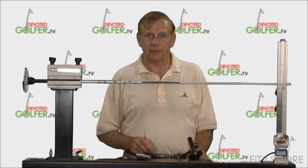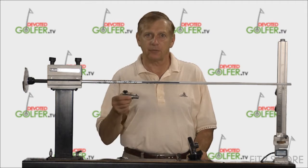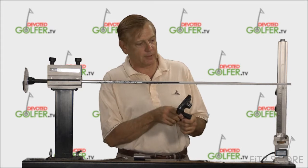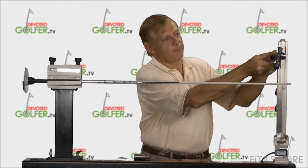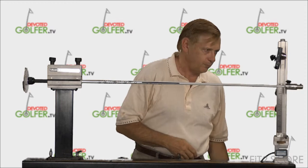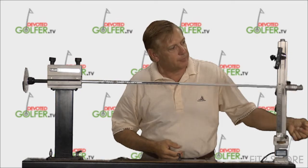By now you're probably wondering where this discussion is going. It turns out there is an easy way to find the stable side of a shaft. It's done with this little tool — a weighted laser pointer and a digital camera. I'm going to set my camera to a two-second shutter delay, a five-second exposure, and clamp it to the arm of my deflection device. The laser tip pointer goes on the tip of the shaft and it's pointing at a board like this one. I fire the camera, deflect the shaft and release it. It will vibrate and the image will show me if I have a stable plane.